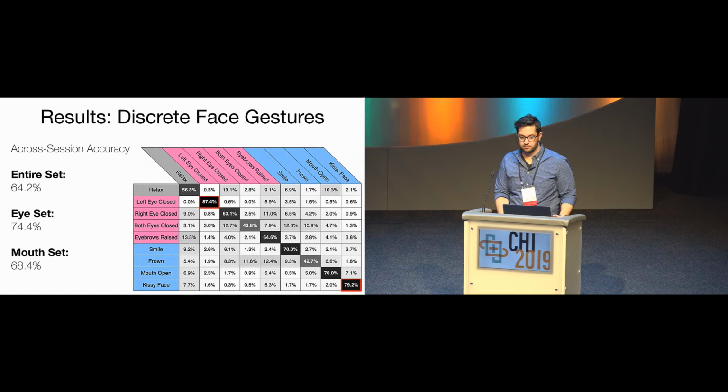Nice presentation. Thanks for the presentation. Simple question. What is the advantage of acoustic sensing over EMG? Did you do any comparison? So EMG has more contact condition issues than acoustic sensing would. For instance, EMG is much more sensitive to sweat. I have hairy arms, so I would have a difficult time using EMG, and I don't necessarily want to shave my arms in order to use the system.